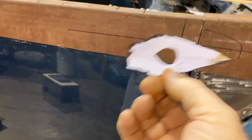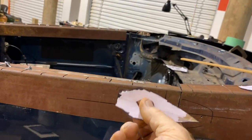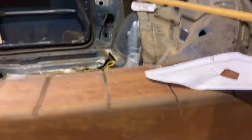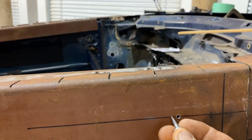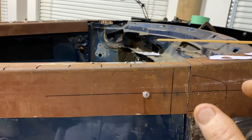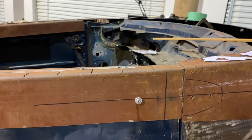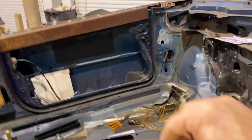Here's what I was going to tell you: if I'm making this piece, I've got to make two pieces for each one — one for that side and one for this side. So I bolted those two rough pieces together and when I sanded them on that sander I sanded them both the same. Then I take them back apart — they already had the holes in them — and I had these little screws and screwed them on. None of this is welded yet; they're soaked in muriatic acid, they're clean. My ace in the hole is I'm going to get Aaron, my business partner, to weld them — he's just an excellent welder.